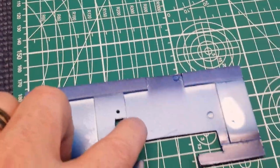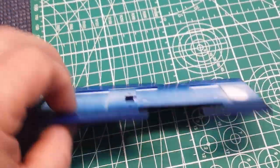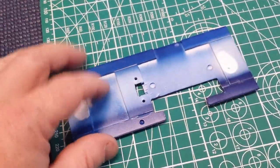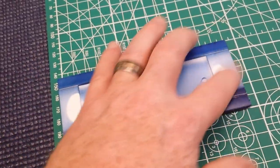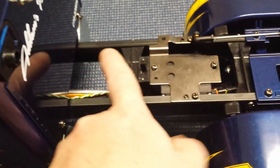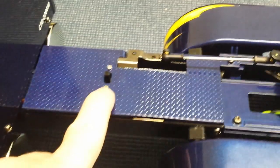There's a little notch on the bottom for a small piece and a couple of lightly-drilled dimples to make room for the screw heads. This is a real thin piece of diamond plate backed with another thin sheet of plain material for extra strength - since we're missing a lot of structure in there - then backed again with a thicker piece. I added strips down the side for rigidity and some in the middle for strength and to support the switch. I'll cut thick foam servo tape to fit along here and then slide it over and drop it right down.